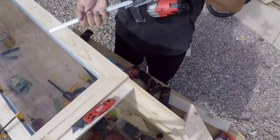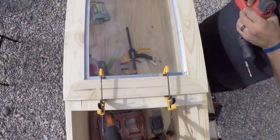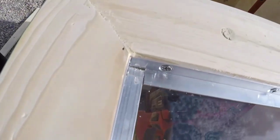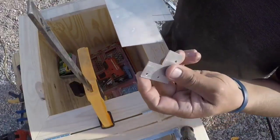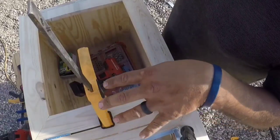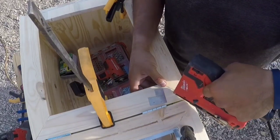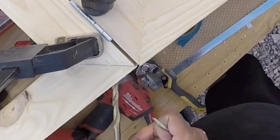The backing on the other side of the frame is one-inch by one-sixteenth inch flat bar, and then this angle sits right inside the frame. In conjunction with the countersink screws, it gave a pretty nice aesthetic look. Not my best aluminum work, but for this I thought it looked pretty good. I cut and slotted brackets out of a random piece of scrap metal — just cut it with a bandsaw. We've got angled squares in there so the glass sits against them, and we'll rim it on the inside with half-inch angle just like the other side.